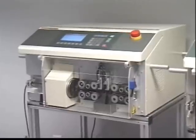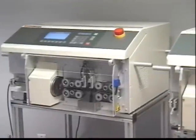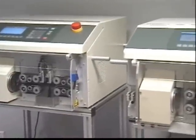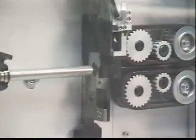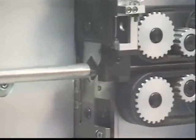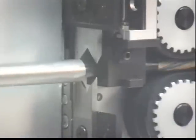The PowerStrip 9500 RS was designed for inline processing of coaxial cable and is equally adept at processing discrete wires with thin insulations. The PowerStrip 9500 RSL incorporates the stripping length capability of the standard PowerStrip 9500 with the rotary stripping capability of the PowerStrip 9500 RS.